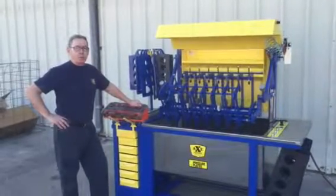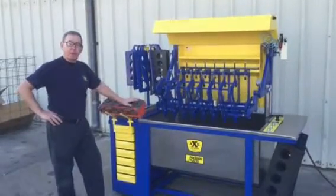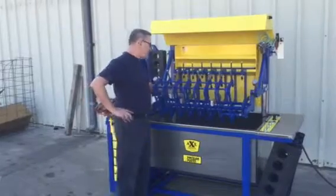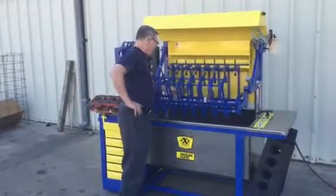We're going to do a little pressure testing on a small block Chevy head here. As you can see, we've got it on our V-wing pegs placed to get it ready to put in the cradle. When you set up these cylinder heads, these 1x2 pinned aluminum supports always stay in the pressure tester.